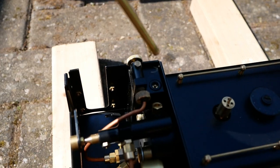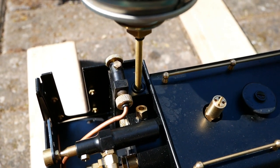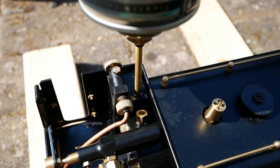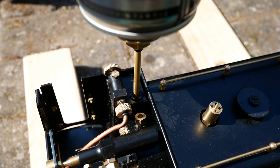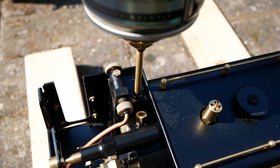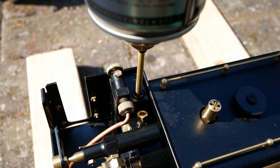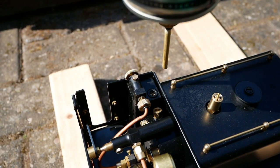The gas I'll be using is a mix of butane and propane at about 60-40%, and Mamod do supply the adapter, or if you haven't got one, you can buy them online. The gas canister needs to be EN417 compliant, so you can screw that on and use the bottle. Make sure your tap is switched off, then press down and hold for about 20-25 seconds, and you'll know when it's full because it will spit back — that's completely normal and that's how you know it's full.